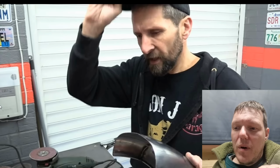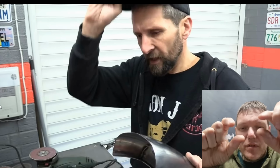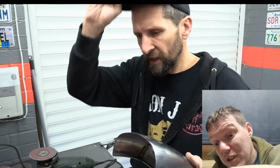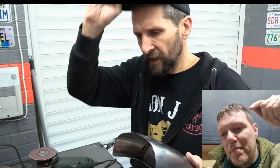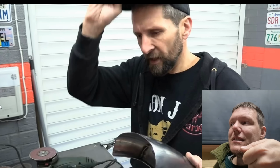When you do MIG welding, especially with thicker material, you always have a chamfer, and you always leave a gap, so the metal falls to the bottom. You'll have to put a backer in if you're going to do that, but you make sure it falls right in there, because like I said, it's just feeding it regardless. Whereas with TIG, you have a bit more control.